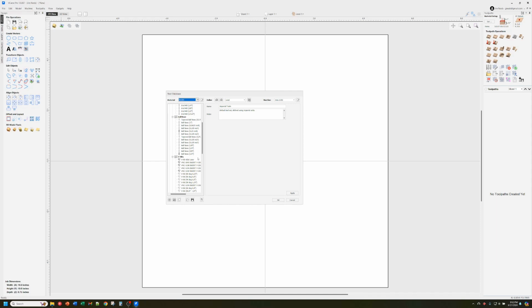You would go in there, say in your end mills. Actually, I put mine in my specialist here, but here's my laser end mill. Basically, just like before, I clicked on specialist and hit the plus and it made a new one. And this is what that looked like. But in this case, for just standard pocketing and profile cuts, I made a laser end mill, not a laser engraving bit. So I used the end mill selection there.